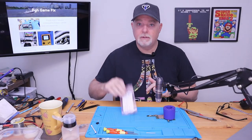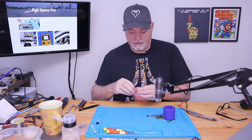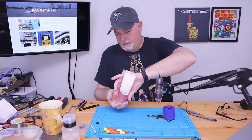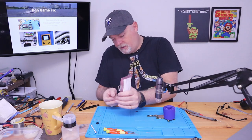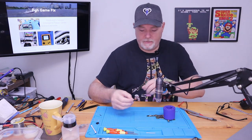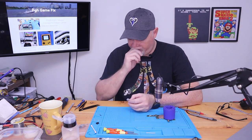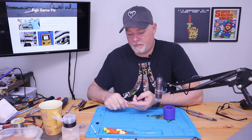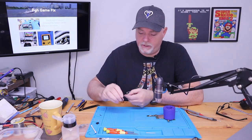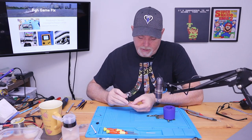Okay, we actually had these on the shelf because it's kind of a common issue. The big problem is people that use a non-standard Nintendo charger. Some of these chargers for phones and whatnot are the wrong protocol. Some are fine, some aren't. And you can see that actually in its little packaging, how small the chip we're dealing with here is. It's truly microscopic. And so are the connections.